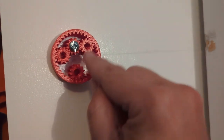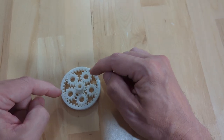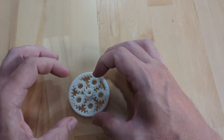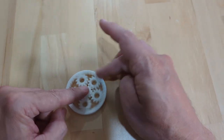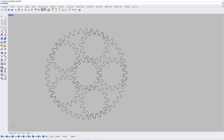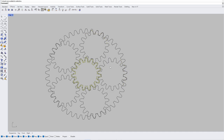To prevent that gap I added two more planet gears into the assembly — it does function, but they're not evenly distributed around the circle. The Sun gear and all five planetary gears are the same size at 15 teeth, which means the ring gear has a 45-tooth profile. Because I have five gears, the number of teeth needs to be divisible by five — 15 divided by 3 is 5, and 45 also divides evenly by 5.